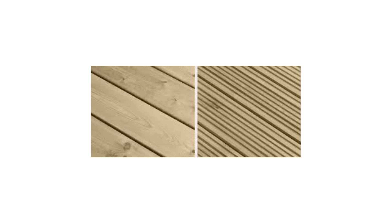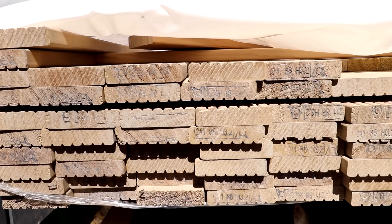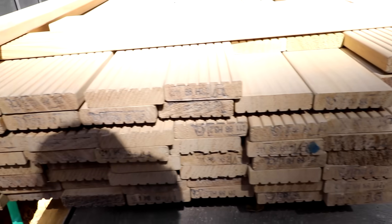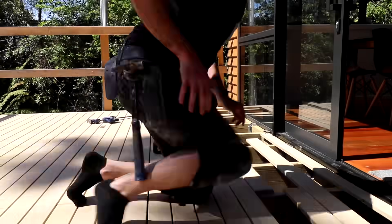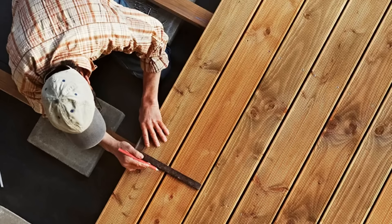Another important question: is your decking going to go groove side up or groove side down? Personally I love putting the groove side down. Decking is usually 90mm or 135mm in two common sizes, and you've got to allow for a gap — say five mils. Work out your overall distance: for example 3,600 divided by 95 gives you approximately how many boards you'll use. You don't want a little slither of decking at one end, or to reach the end with a 10 mil gap where you had perfect five mil gaps the whole way. Mark it out in pencil and adjust if needed.